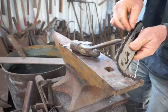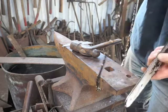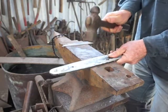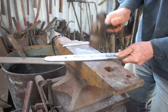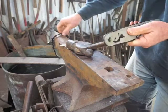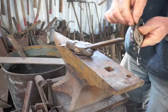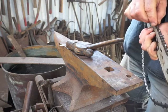It's a bit loose right here in the middle still. If you get a really tight pinch point, you can get it hot enough to heat up the bar in that spot and you'll get blue spots - blue spots where the friction of the chain going through the bar has heated it hot enough to temper it to that blue color.